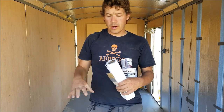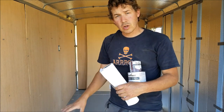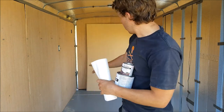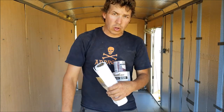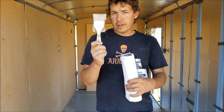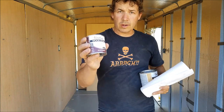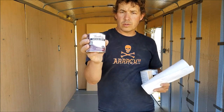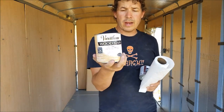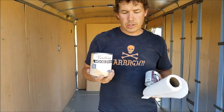I'm ready to varnish now on the interior here. I rolled up the floor — it was only glued on around the edges and it was bubbling in a few spots. So before I put everything back in, I'm going to glue the whole floor down so it's smooth and flat. For painting, I've got a cheap paintbrush I can use for the siding and then just throw it away when done. I've got some paper towels to clean up with. For stain, I've got black Varathane for the small trim pieces and natural color Varathane for the siding, so the siding will just get slightly darker from being wet but not much. I've also set up a fan in here blowing out the door.